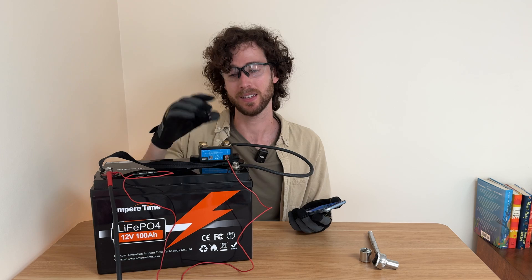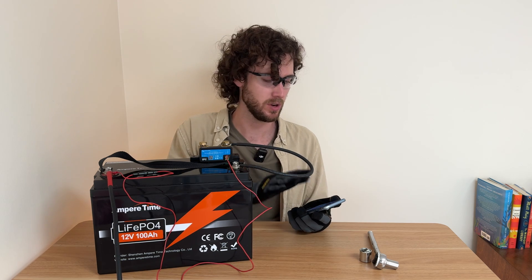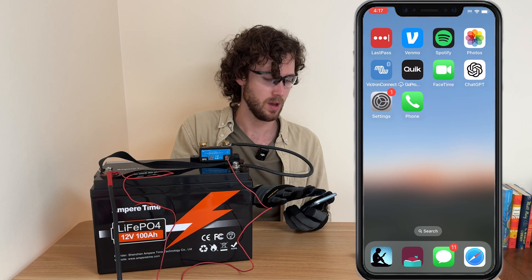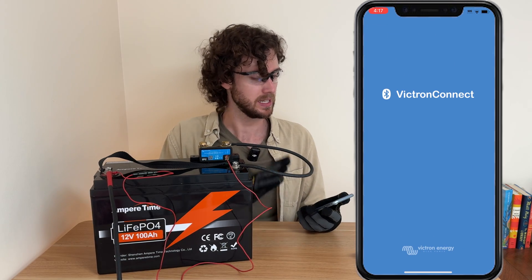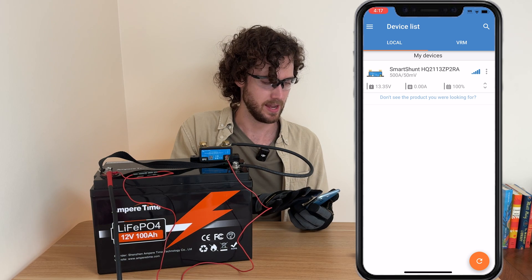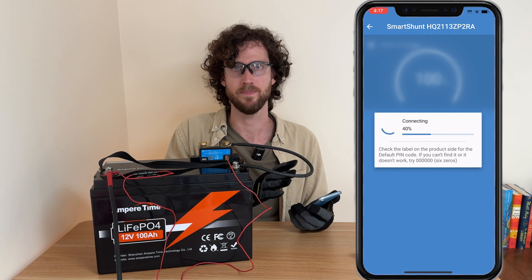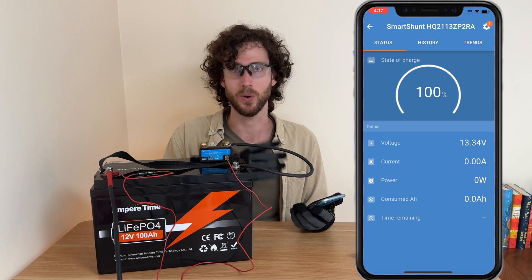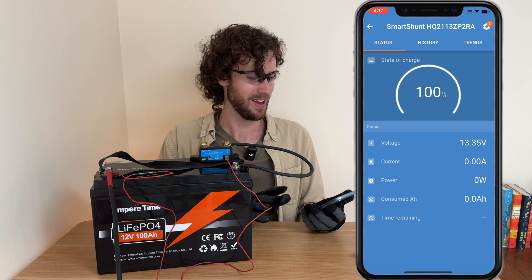If this is starting to feel a little complex, that's okay — I'll talk about some alternatives to battery monitors at the end of this video. You connect the Smart Shunt to your phone using the Victron Connect app. Download it if you need to, open it up, and you'll see a list of devices. You might have to do some software updates when you first connect, so do that if necessary. Click on the Smart Shunt, enter the pin — it's six zeros by default — and then it will connect.